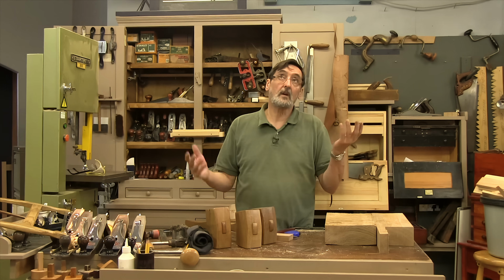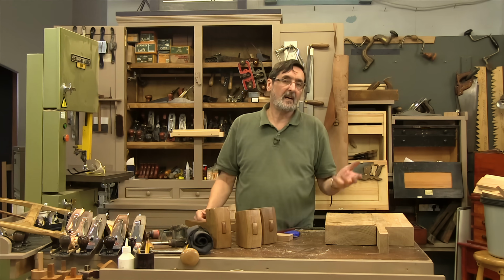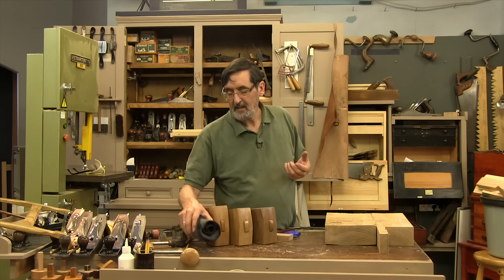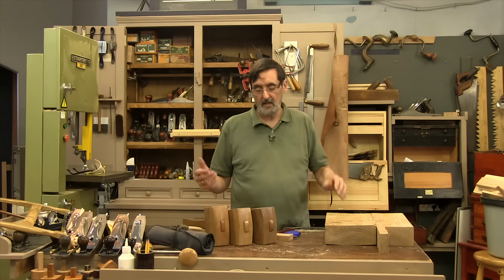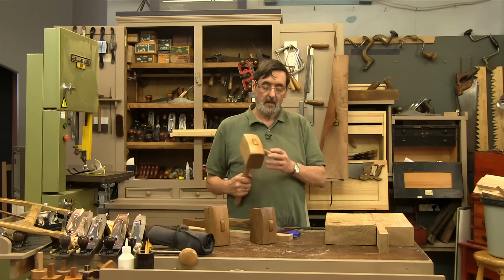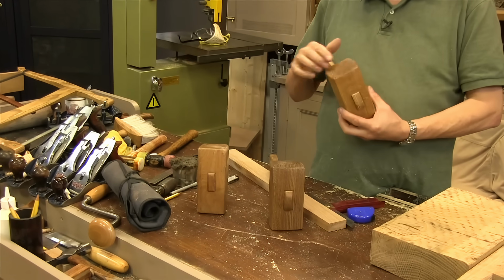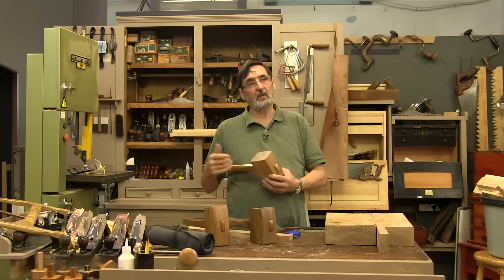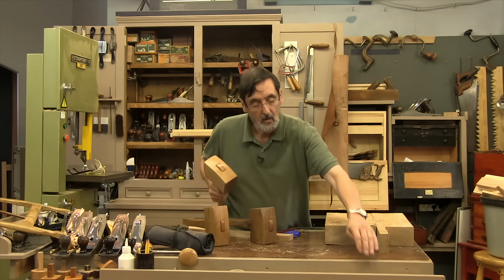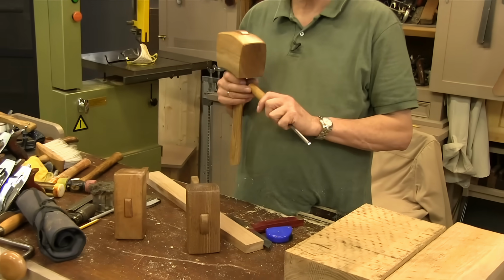Most carpenters are using chisels and hammers, and it just seems incorrect even today for me, because I like the use of a mallet, but mallets somehow transfer weight. You get the center of percussion, you adjust them, you can work with them. They're very good when you have a small chisel handle, you're working on close work or whatever. They just somehow deliver the blow right where you need it without thinking.